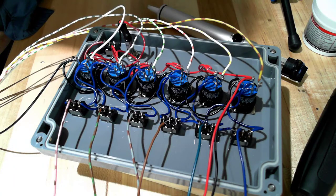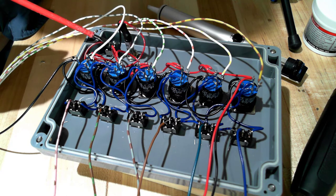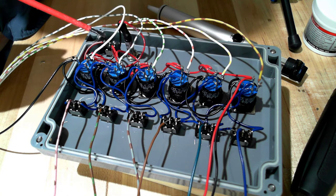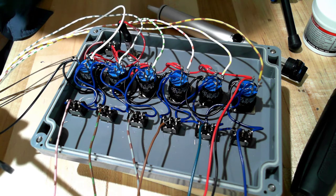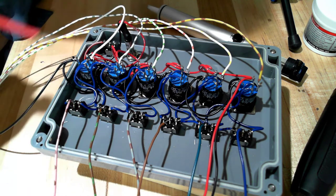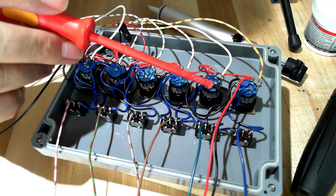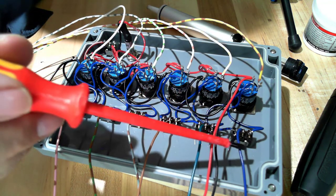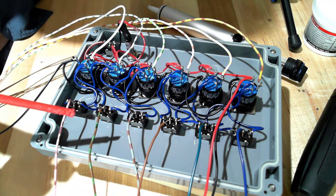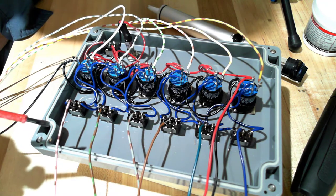There's only one more wire that has to leave the lid area underneath the top of the box, and that is the center lead on this toggle switch, which has to go into the bottom half of the box to the power connectors that go to the 24-volt DC adapter. Other than that, we have everything else connected. We've got a red and a black that carry plus 24 volts DC and common up to the I/O module. And then for inputs, we've got a blue, green, brown, gray with brown with green, and pink with brown. Those 6 are the 6 inputs.